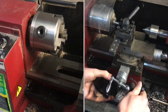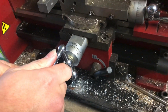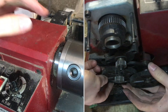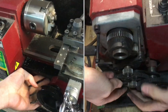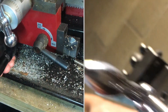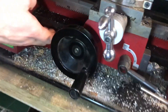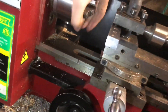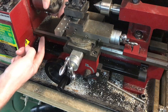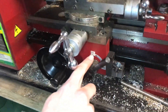The Harbor Freight Mini Lathe does have an auto feed. It's this lever right here, and it's combined with the threading — the same lever is used for both. There are gears in the back of the headstock that connect the spindle to a thread underneath. Right now the half-nut lever is engaged, so the teeth are engaged, but nothing's moving because it's locked to the static thread under here. If we rotate the chuck, the whole carriage moves, and as soon as we disengage, nothing moves because the half-nut underneath is no longer engaged.